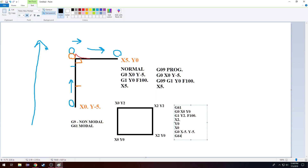Of course, if we want to cancel the G61, we can just put a G64 at the end — but I'll go ahead and explain that in another video. Basically, G61 switches to exact stop mode, and G64 switches back to normal cutting mode where it's going as fast as it can. Anyway, that's pretty much all I have for G9 and G61. If you have any comments or questions, please leave them in the comments and I'll try to get back to you as fast as I can. Thank you everyone for watching, and I'll see you next time.